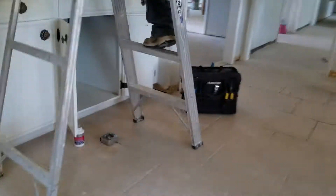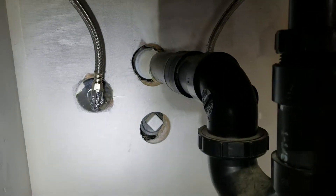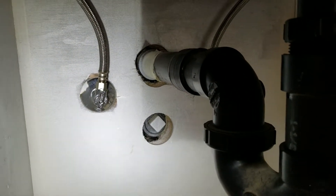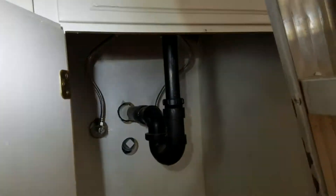So that is the kitchen, and over here at the bar sink — same thing. Got two shutoff valves and these are from Ferguson — one hot and one cold. The nipples did not come out of the wall so we left those in place. We provided 20-inch braided stainless steel supply lines — three-eighths by half-inch by 20-inch Fluidmaster, and we get those online from supplyhouse.com.